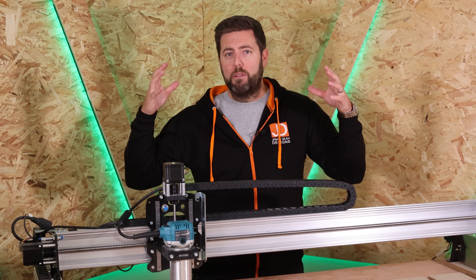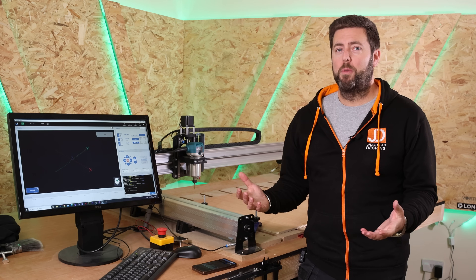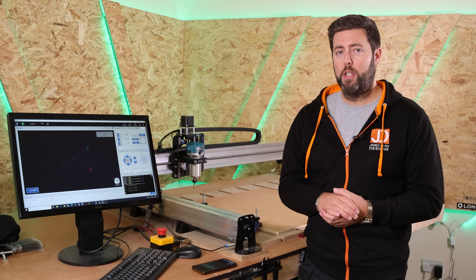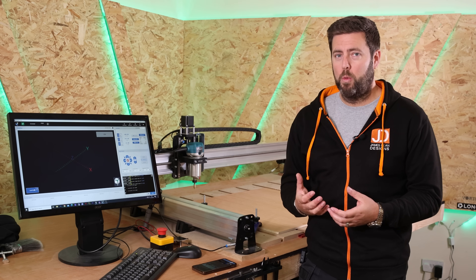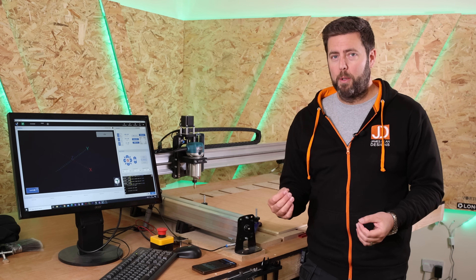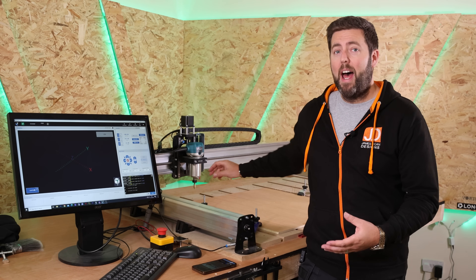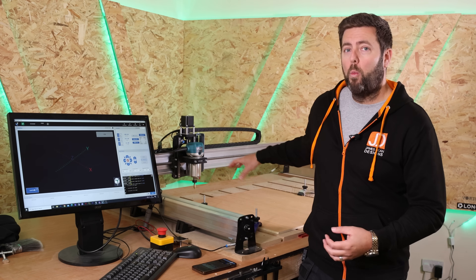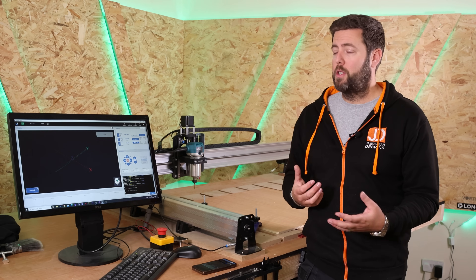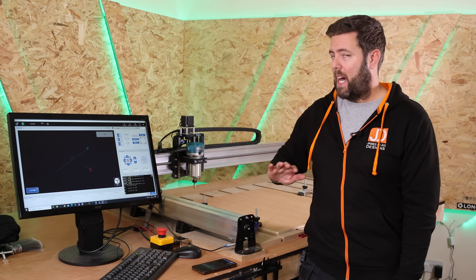Let's get set up on the PC and I can show you just how good this command is. Now, in order for this command to work, the machine needs to know where that head is at all times, and to do that we need to home the machine — so you do need to have limit switches to make this work. You may hear terminology like machine coordinates and job coordinates. Your machine coordinate is your CNC machine knowing at all times where that head is. Your job coordinate is your machine knowing where to machine that job and what movements to do within it. The first thing we need to do is home the machine so it knows exactly where the router is at all times.